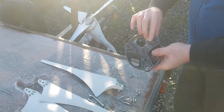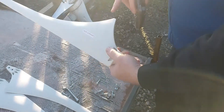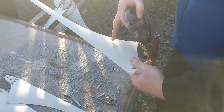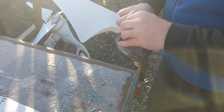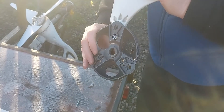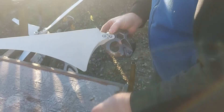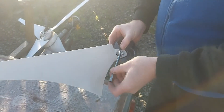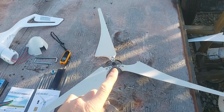I've got the hub here and on the back it's notched out to take the nuts so you don't have to hold a spanner on the back. I'm going to take the blade — leeward side, the side not facing into the wind — and place it onto the hub. Take one of the bolts, start it in the nut on the back. Don't nip the nuts all the way up until you've got the other bolt in. Do that for all three blades, then tighten them down with the tools provided from the kit. That's now the hub unit with all three blades attached.